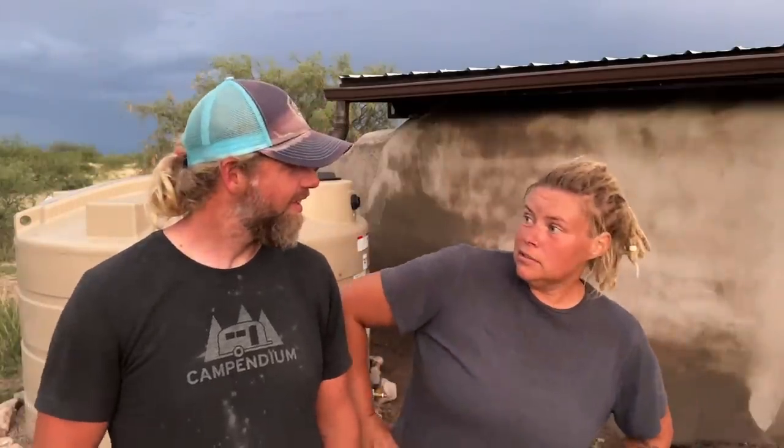Yeah. Hey, but we got it. We learned a lot. Yeah, we learned that just because your fascia boards are up there doesn't mean that they are level. Now, the boards, I knew the boards were warped. Those 1x6s were warped, yeah. Anyway, we ended up with not quite the right slope once we installed it, so we had to sort of make some adjustments. But it was good having the water to test it because as soon as we found that right pitch, it just ran right down. And it did what it was supposed to, so.